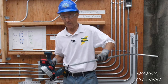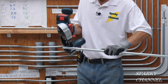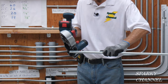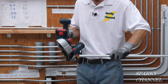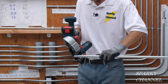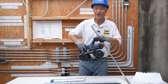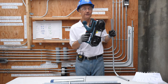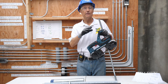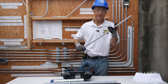Let's see it work. Here's half inch EMT — you can just cut it all day long, it's not a problem. It's got a Bosch blade on here, 28 and 7/8 inches, and it's a 14 to 18 teeth per inch. It's a really neat blade. Half inch EMT is not a problem.